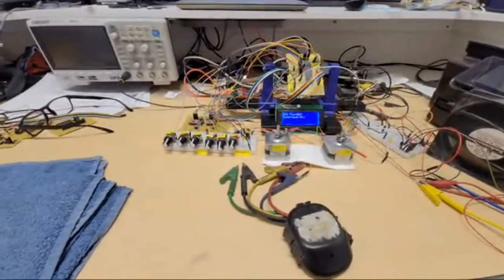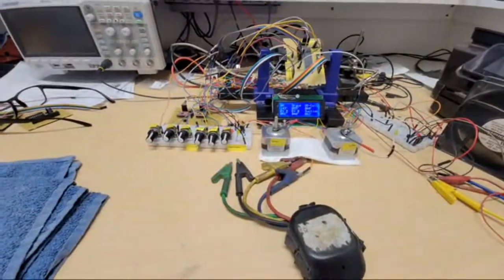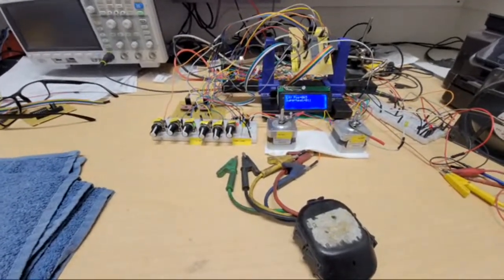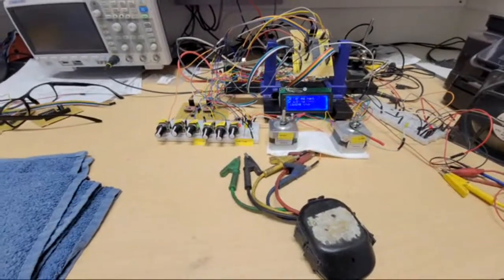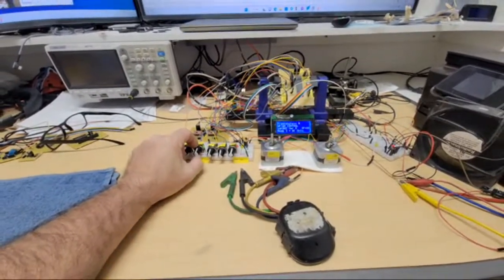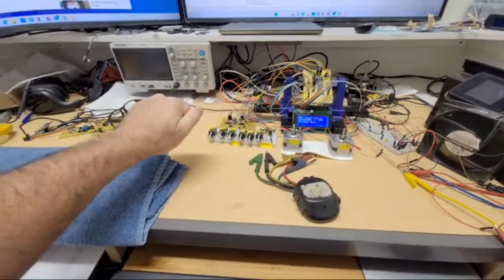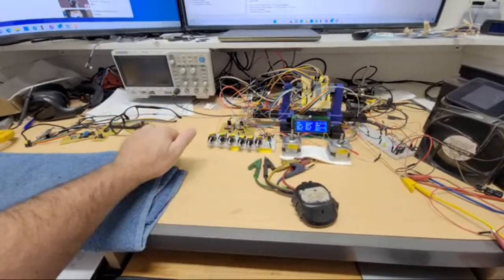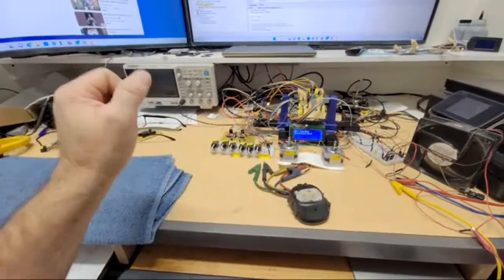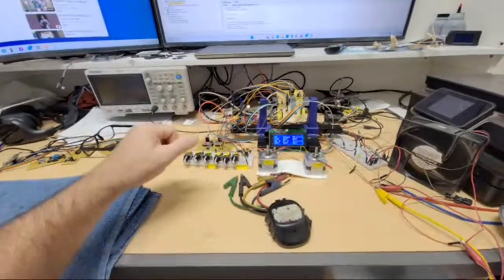I'm not doing a full PID, having a brain fart. I know what the P stands for, I just can't say it out. My mind is thinking in the integral and derivative. So basically, it's like trying to adjust a faucet to start filling a sink. You open it so much, and then you're looking at the correction like, all right, I want to get to this level, and then you just slowly start increasing to get rid of that error. And then as it gets closer to hitting its target, you start decreasing it, like derivative, because you can see it's going to hit the target. So you start backing off.